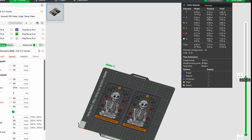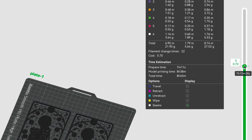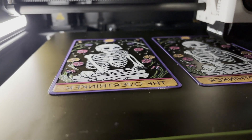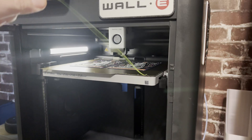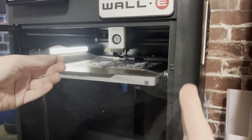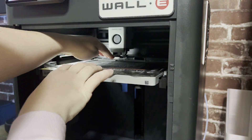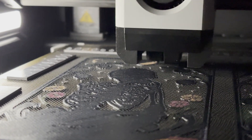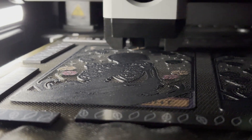Once I've got it sliced I'll get a time and filament total — it's a longer print but I don't mind. Then I find the layer transition point where we go from color to straight black. Remember, the pause is going to happen before the layer you select is printed. The additional layer thickness helped get some nice clean lines, so I may try that with my regular bookmarks. Just like before, when the printer pauses I go in and lay down the tulle — I used black tulle for this print, which I think goes better with the color scheme. I secured it with magnets in a taut layer and restarted the print. I also cut up my magnet strips, which made the fabric tightening process easier. As you can see, I put the pause in the right spot and all of the filament going down on the tulle is just straight black.